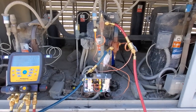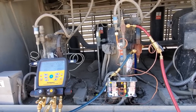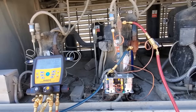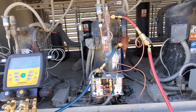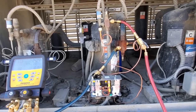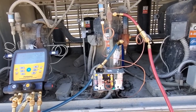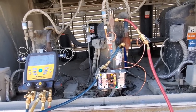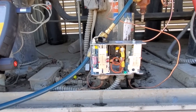One of the dilemmas you have with a scroll compressor is they don't like to pump down to really low pressures. What you'll notice is short cycling. The newer scroll compressors, when they shut off, have an internal pressure relief — the pressures will equalize if it gets too low, because compressors don't operate properly when they're in a vacuum and you can actually damage it. If you have the pressure control set too low, it'll pump down and then you'll hear a bleed-off — the pressures will equalize. There's an internal pressure relief and then it'll short cycle. Copeland has a service bulletin where you put a time delay relay on these things, which helps a little bit. But you still have to be careful about setting these pressure controls too low — it's a fine line finding that happy set point.